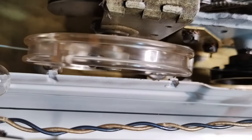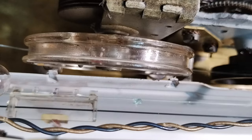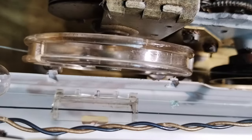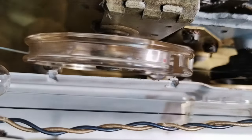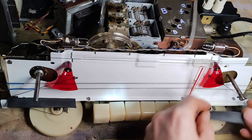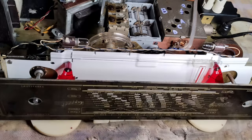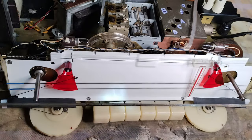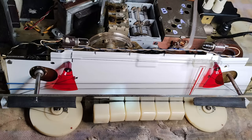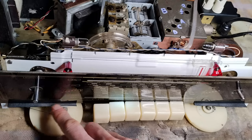There is less than 1 millimeter between the additional variable capacitor drum and the dial panel. Everything fits perfectly, and that was luck. The dial glass must be held, separating it from the metal parts with rubber. While the original pieces of rubber were consumed or too hard, some new rubber was used, cutting the pieces from an old bicycle inner tube.